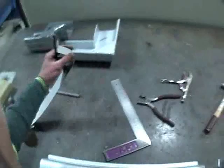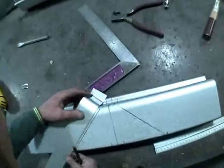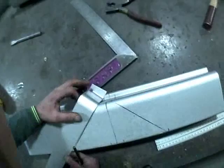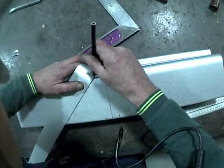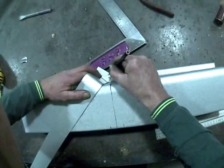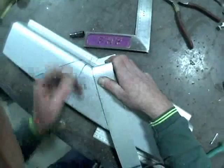We get a bit of sheet metal and bend it to about the shape of the spouting — at right angles with a little toe on it at 90 degrees. We sit that on the spout and we can see it's the same shape. With the use of this bracket, we can connect our lines up for the curve — sliding up the front and along the baseline, we can draw the curve in along the roll of the spouting. We can also mark the front bead with the allowance we've made there. When they work out in the right spot, you know you're correct, because this will be one continual 45-degree line through the spouting.